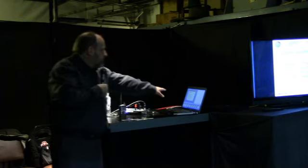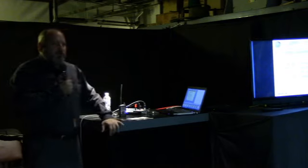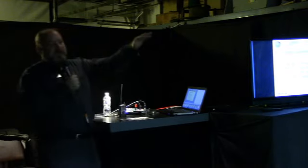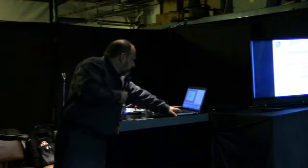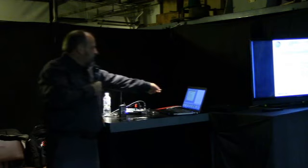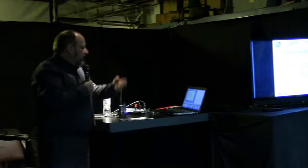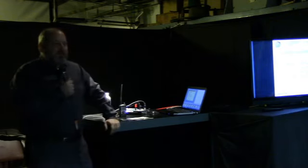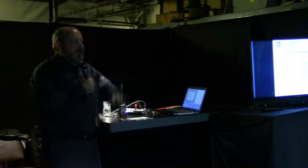And here, if I wanted to talk to a specific user, all I have to do is put that user's call sign in the UR call field. The system will go find them, and you'll be coming out on that system. And this is if I wanted to connect to a specific machine. So I transmit this, and my call automatically goes out this K5TITB, so I end up coming out on 70 centimeters in Texas from wherever I am.